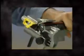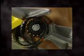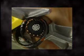adjust as necessary. Then begin to rotate the tool clockwise while applying a slight forward pressure to engage the blade in the jacket material. During the first revolution, advance slowly and adjust the blade as necessary to allow jacket cutting while keeping the blade above the neutrals. After one complete revolution, assure the blade is not contacting any concentric neutrals and continue stripping.